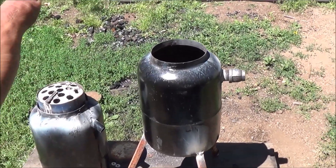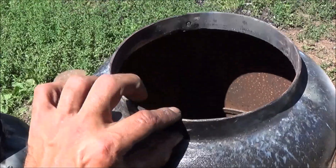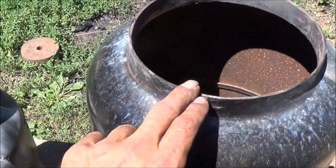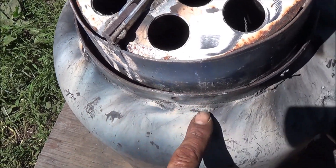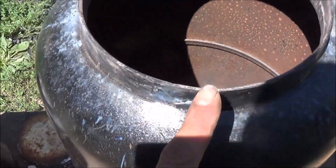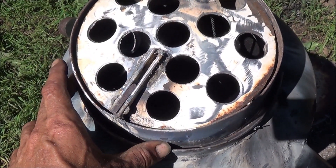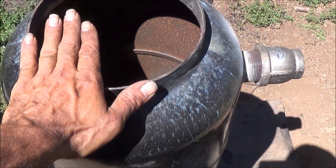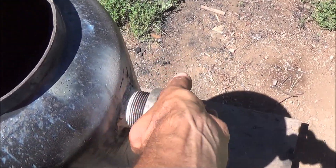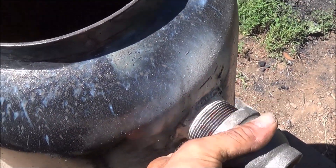We've completed the upper. I showed you them kind of sitting down inside of each other. Now I've completed all the seal we needed to make a nice seal between the upper and the lower. You can see this rim sticking up right here — that was the old ring on the bottom of the propane tank. The reduction zone itself slides down inside of that ring. This ring's lip fits right here. You can see this gap that I've left — that's another one of the rings from the bottom of the propane tank. I've just expanded it, made it wider, and it allows for the ring from this one to sit up inside that groove. We'll put some oven and stove door rope inside of there, and that'll give us a really nice gravity-based seal. The lower's ready to go — I've got the legs on it now. Here's our gas output: it's a 2-inch output, and I've got a reducer on it done. Simple threaded coupler — it allows you to go to whatever you want from the gasifier.